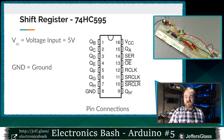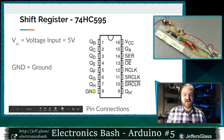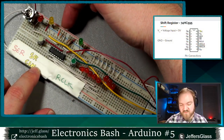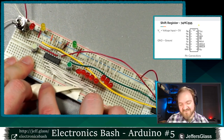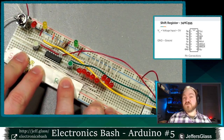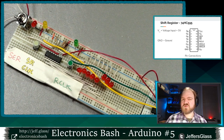And then the last couple pins to mention, just because we haven't already, we have this VCC pin and this ground pin. The ground pin, you've probably guessed, is ground. VCC means the power supply pin. So in our case, that's 5 volts. And again, I just used a couple little bits of wire. I've got this little orange wire here, tying it to my power supply here to connect to 5 volts. And I've got a little sneaky wire under my labels here, connecting the ground pin to ground. So make sure you hook up your ground and 5 volt pins or your circuit won't work, or at least it probably won't, especially if you're hooking it up to an Arduino.